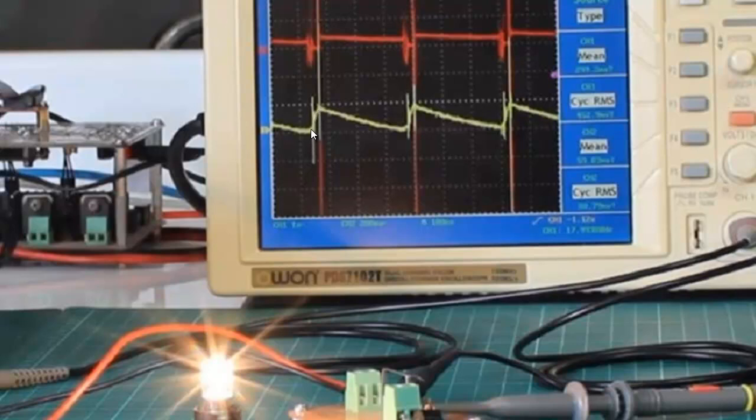The interaction in here is a resonant interaction between the two partnered output coils. What I mean by that is the magnetic fields get to maximum amplitude for the minimal input force, or input current. They get to maximum amplitude for a given configuration. Each partnered output coil interacts with each other differently in this region, depending on things like turns, coil length, and the core. They all work differently, and that's why it's a little hard to predict. But at the end of the day, the same basic processes apply across the board. So this is your input region here, and this is your work region over here.